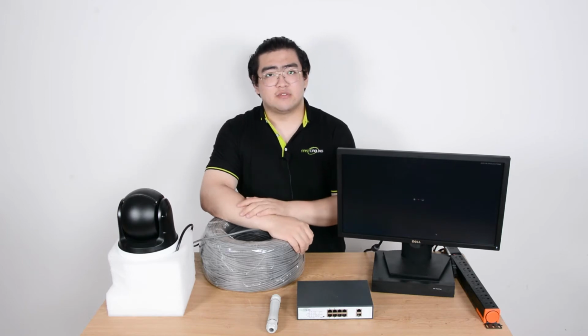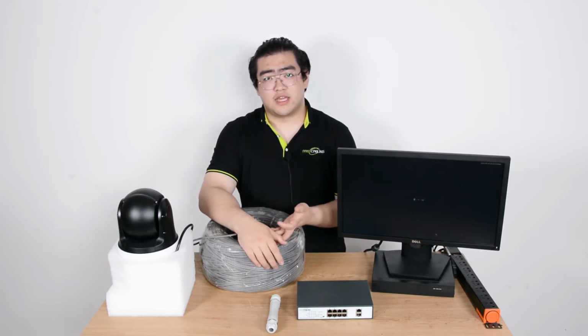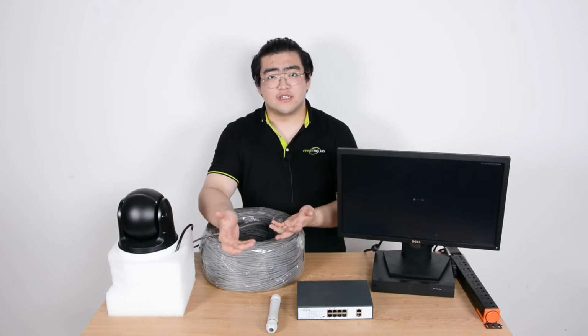Although it has some downsides. A PoE can only transmit 100 meters. After 100 meters, there'll be power loss and signal decay, so we're going to need to use devices to extend it. In this video, we're going to use one method.